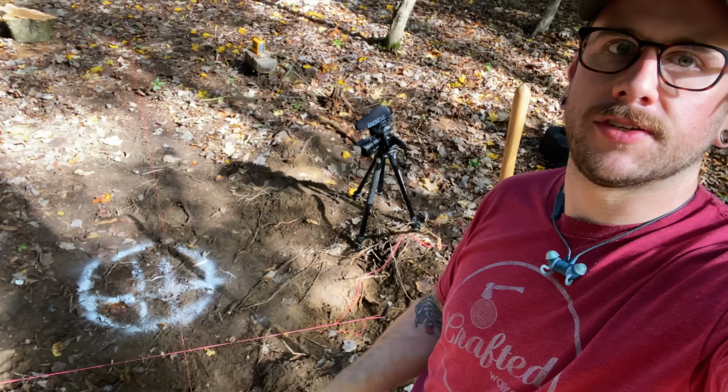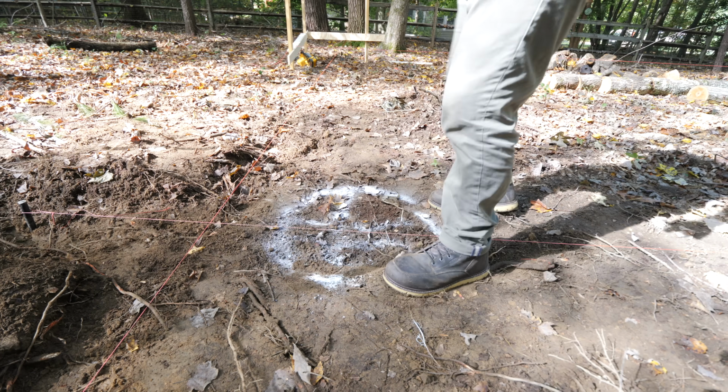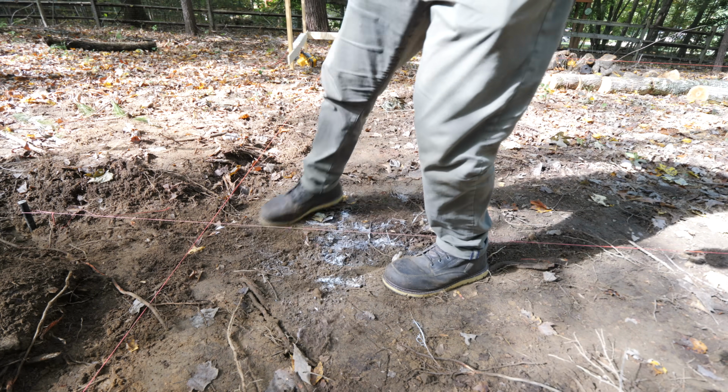So just called the engineer and he confirmed that 12-inch sonotubes should work just as well for this project. So we're gonna change to 12-inch diameter, which is gonna, I think, just look a lot better just because it won't be this huge post sticking out of the ground. We laid out the footing again, and this looked a lot more reasonable.